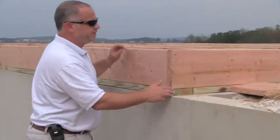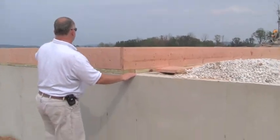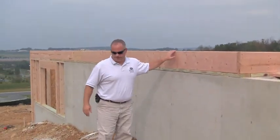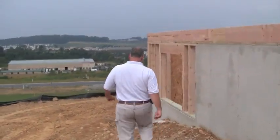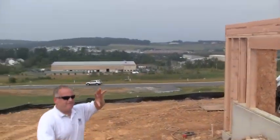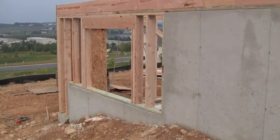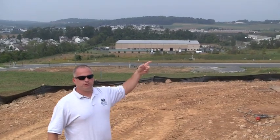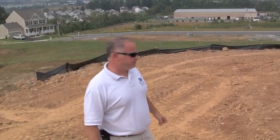You can see the framing starts here — that's because this is the front porch area. So this is actually the house structure. We have these 2x10 fir joists put in here, and they have everything all boxed out. Down here, because it's a walkout basement, instead of having big concrete walls all the way around, they frame out wherever it's basically coming out of grade. It looks nice — we'll put siding on there. We use 2x6 wall framing, and in the basement we put it on 16-inch centers because it is part of the foundation, just for more structural integrity.